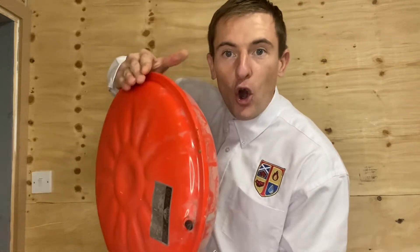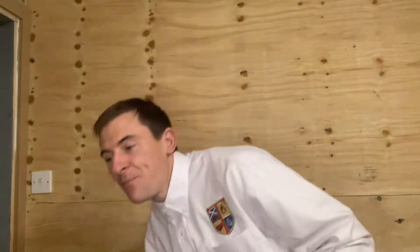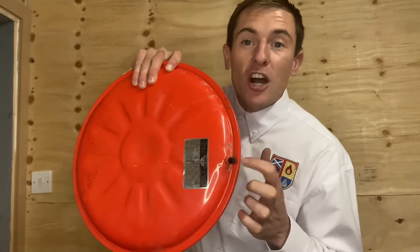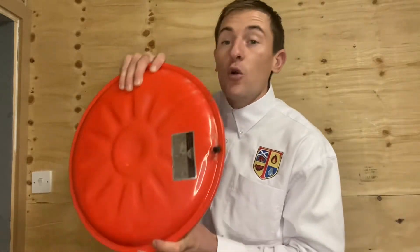Now if the charge is gone on the other side, or there's a burst in the diaphragm — which happens regularly, these are common for having problems — during a service, that's one of the reasons why you should service your boiler or heating, because these need recharging regularly, they lose the charge. Another place the air escapes is through the Schrader valve. Also, a lot of systems have these undersized, so they need an extra one in the system. Normally if there's more than eight or nine radiators you might need an extra expansion vessel, depending on the size of the radiators and the system.